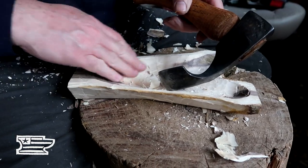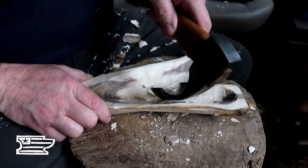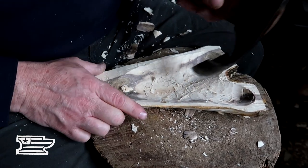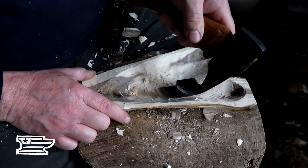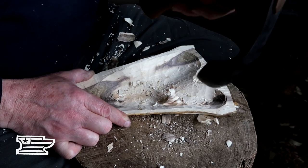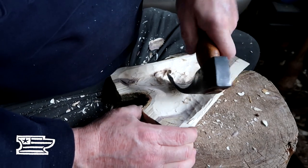So I'm kind of done as far as I'm going to go with this pass, and now I'm just going back and starting to clean up a little bit. This is really gnarly stuff in here, so I'm just kind of picking my angles of attack. What I don't want is a big tear out, so I'm going about this carefully, feeling my way through it. Eventually I'm going to have to give up on my adze and switch tools. I'll always keep the bigger tool going as long as I can — the tool with the most impact.